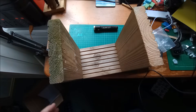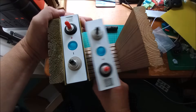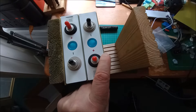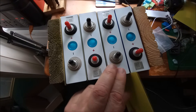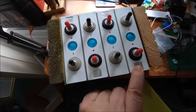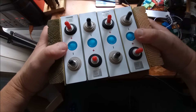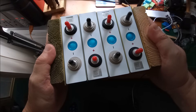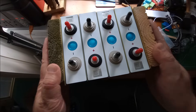Let's pop the cells in this frame to kick off. I'll use these plastic sheets between the cells and reverse the polarity of the cells as I put them in. Let's get the two remaining cells in. I'll put the fourth cell in without its plastic sheets just for the moment to get it in, then put the plastic sheets between the cells. The final plastic sheet goes at this end — that all fits pretty good, but there is some movement. 400 kilograms force is half the weight of my old car, so it's a lot of force. I've had to think about some reinforcing hardware, which I'll go and get now.